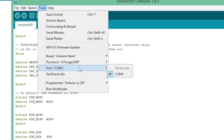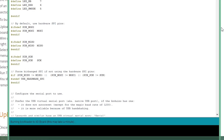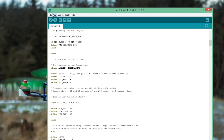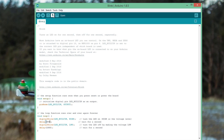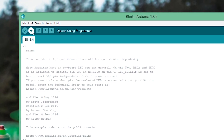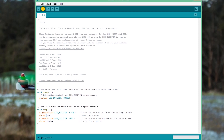Make sure the correct COM port is selected, then go to Tools and click 'Burn Bootloader.' After that, we can upload our first sketch — in this case, the blink sketch. This simple sketch lets us verify the upload worked correctly by blinking the LED. To upload a program to the microcontroller, go to Sketch > Upload Using Programmer, or hold Shift and click the usual upload button — you'll see it says 'Upload Using Programmer' instead of 'Upload.'